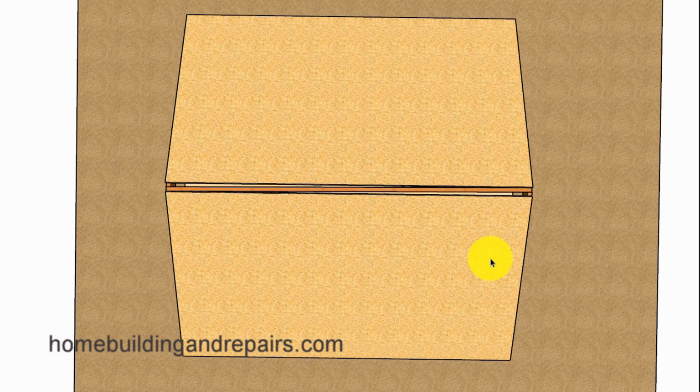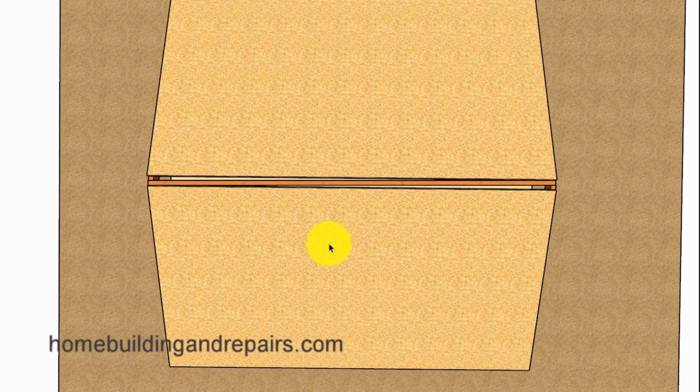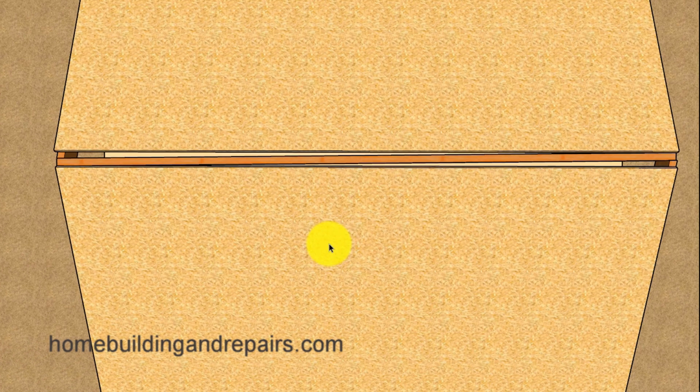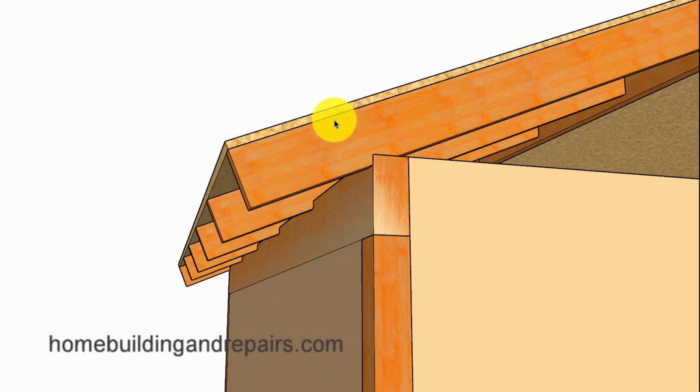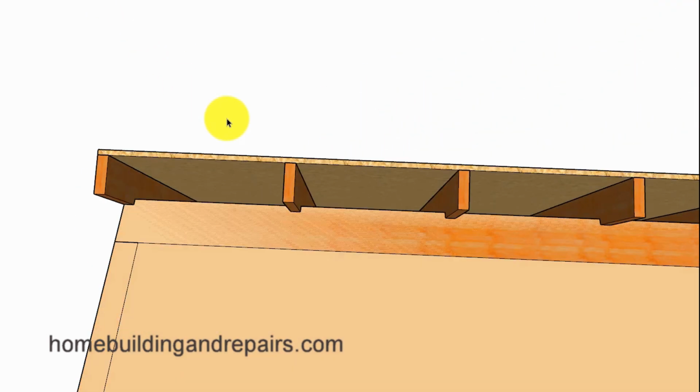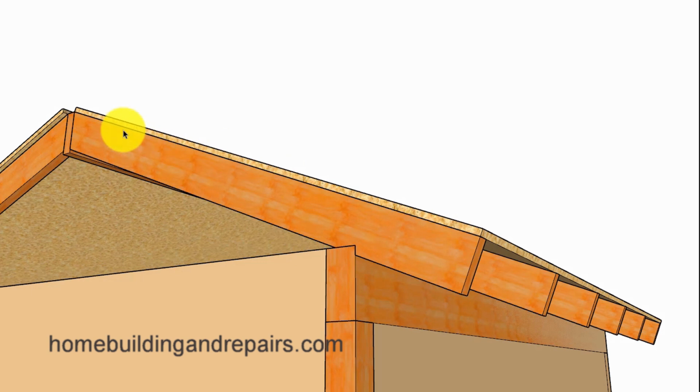And in the last part of the video, I want to take a couple of pieces of roof sheathing, and obviously they're large pieces of roof sheathing, but they are going to be level, they are going to be square, and they are going to provide you with an example of just how far off the overhang might be on either one or both sides of the building. As you can see here, there are no problems with the roof sheathing and everything is nice and square. The roof sheathing fits tightly on the top of the roof rafters and creates a nice level flat plane.